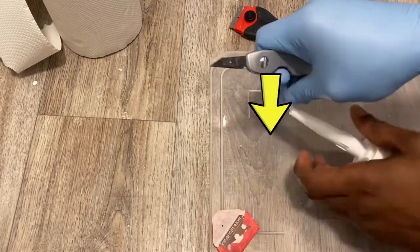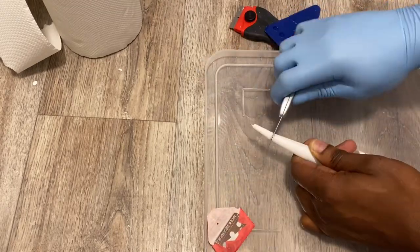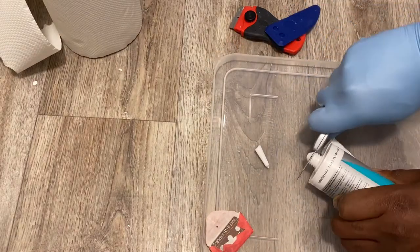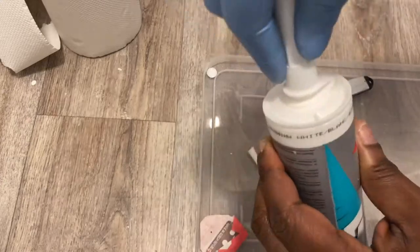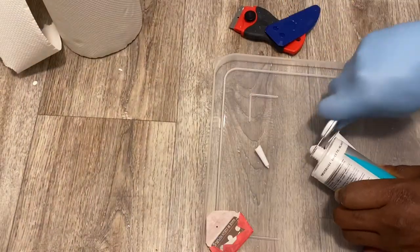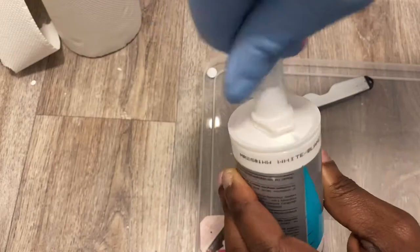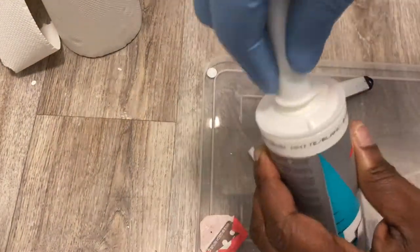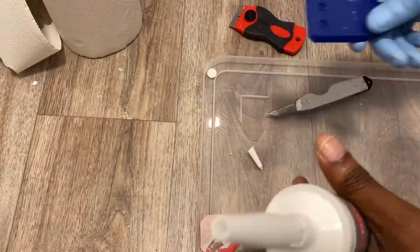It's the blue kit that I've got in my hands. It's important to match the gap so you do not waste sealant. So I will cut the nozzle tip at 90 degrees to enable a push fit type application that would propel the sealant at 90 degrees into the groove or gap, as opposed to just gliding through at 45 degrees.